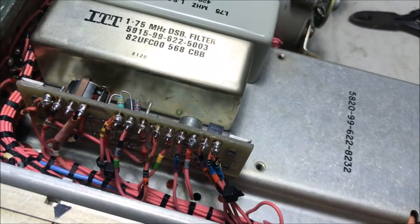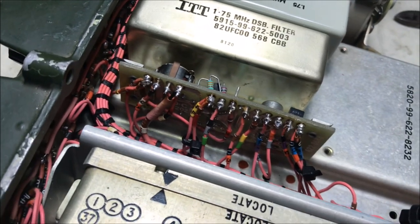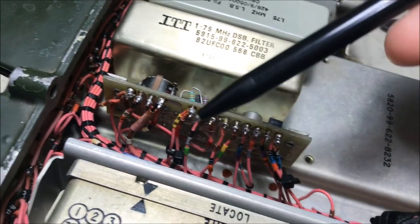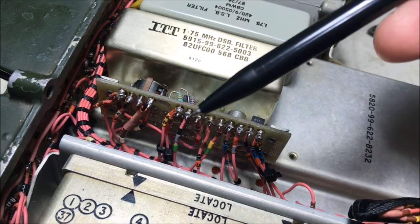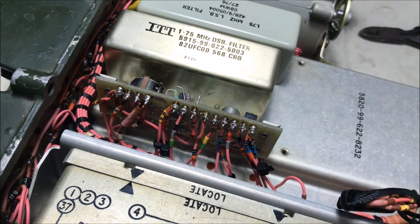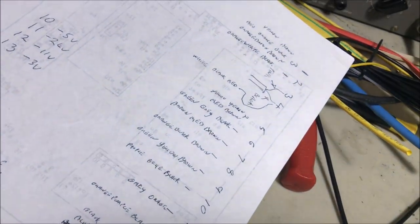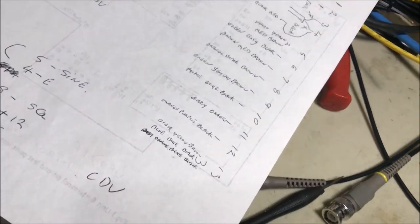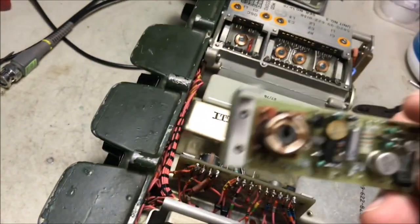So of course this is the board, the 1A board, and of course, just unsolder all the connections. I marked them all with little pieces of masking tape and numbers. Actually made a little diagram there, you can see, of all of the terminals, the little color coding on them all, so I wouldn't get mixed up. And yep, the old board came out.